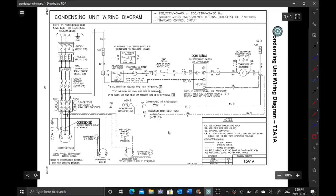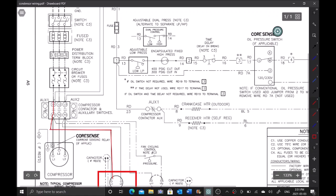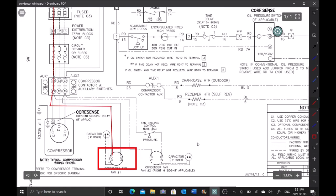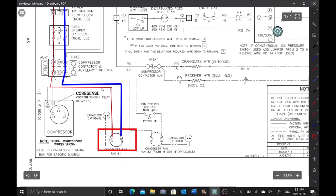Let's go look at the schematic. First things first: find the load and work backwards. Condenser fan is running, so I don't need to take a reading off that. L1 is coming off of T1, straight shooting through our circuit breaker and terminal block up to the top - that line is complete to that section. L2 is coming off T3 through the contactor through the circuit breaker, branching up to L3. So far we can draw this off on the schematic.